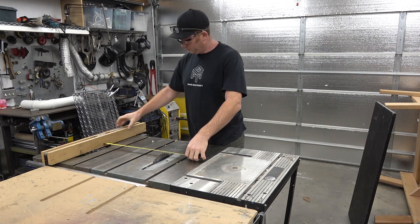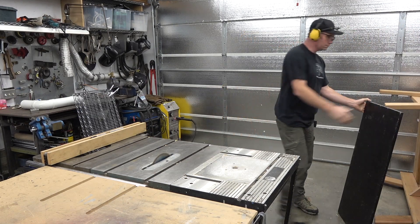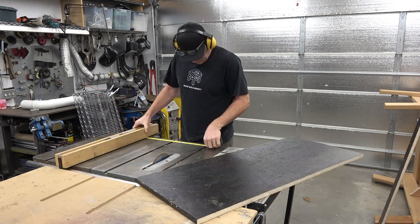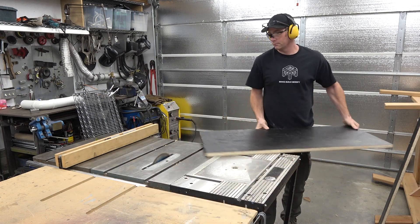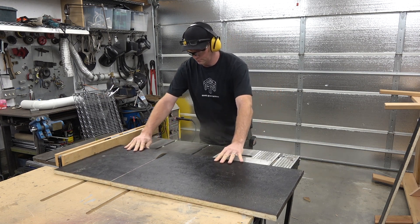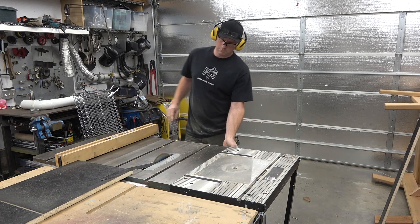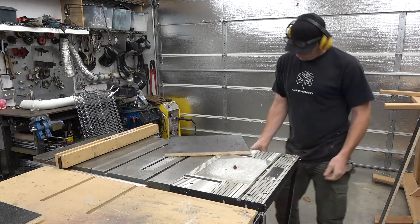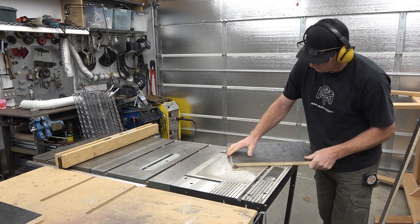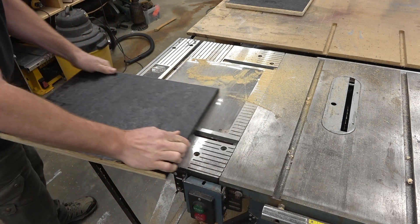For this particular set of shelves I'm using 7/8ths OSB. It's a scrap that I had laying around and I'm cutting it at roughly the depth of the shelves, and then I picked 20 inches for the height. You can pick any arbitrary height between the two shelves you'd like and adjust to suit your needs. I like to round over the edges on the panels just to keep from skinning my knuckles when I'm loading stuff on the shelves. This is a completely personal preference — you can do it with just square panels or do whatever else you'd like.